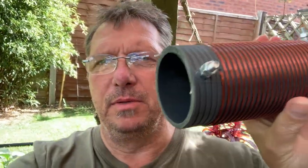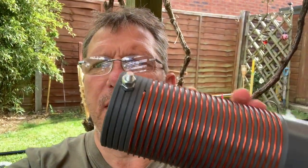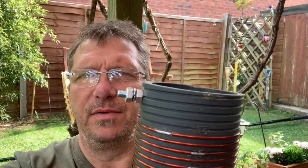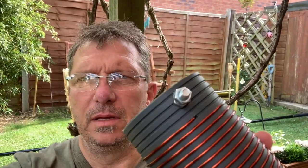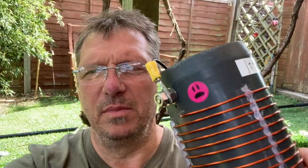The pipe is three-inch diameter. A good friend of mine, Brian, BZU, has a lathe and has cut this pipe with a thread, five-millimeter spacing for me. Obviously not everyone's going to have a friend that's got a lathe, so the alternative version is to glue and wrap again with five-millimeter spacing. Anyway, here we go.